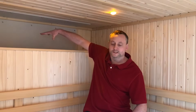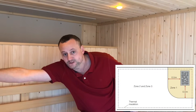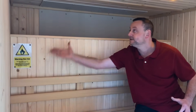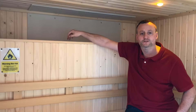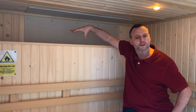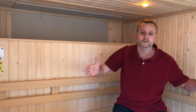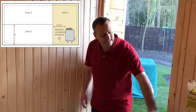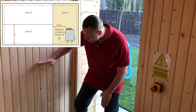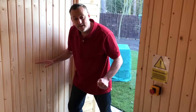You must check manufacturer's data to determine whether the heating element within the sauna can have RCD protection. Zone one is the sauna itself and comes out around half a meter — just here is about half a meter out — and there is no associated lighting in zone one. Zone one comes out from the sauna half a meter and all the way to the ceiling. Zone two comes away from zone one and is a meter up on the wall, all the way around excluding zone one.